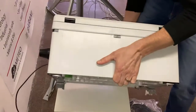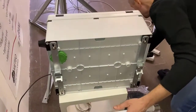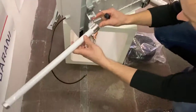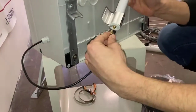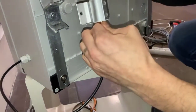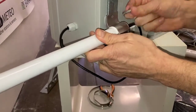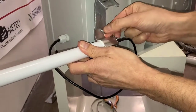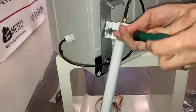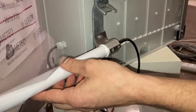On the back you can find two holes for mounting the large antenna. Connect the antenna cable to the antenna and tighten it — you can use a wrench to tighten it a little more to prevent vibrations. Then use the supplied screws to screw the antenna in place. Use a Phillips screwdriver — a small flathead can help for quick assembly, then tighten with the Phillips screwdriver.